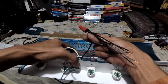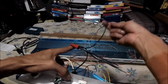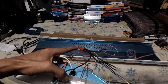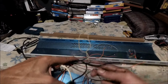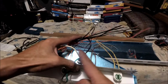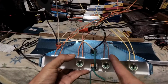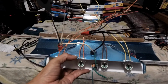And then I did yet again a 6-way splice because there's 6 conductors. So first the main one, and then the one that goes again to the other end of the tombstone for the chain link or the daisy link light fixtures if you want to connect another one. And then the rest will pertain to each tombstone, okay? Because each tombstone is going to receive its own individual neutral and its own individual hot line or live, okay? And that's what I'm going to do. So I'm going to link them up.